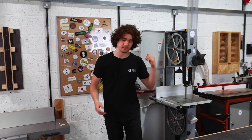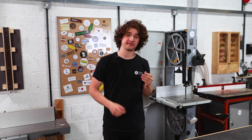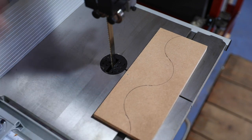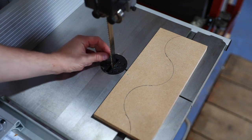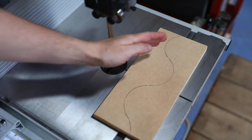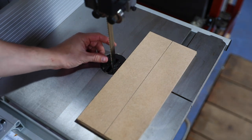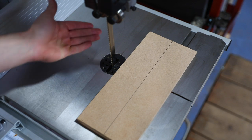The second specification is the width of the blade from front to back. This varies by machine — specifically the capacity of the thrust wheel at the back. This machine can take anything up to three quarters of an inch wide, which is around 19 millimetres, whereas smaller benchtop or hobby models usually only go up to a maximum of five eighths or even half an inch. If you're cutting intricate shapes like bowl blanks, you'll want a thin blade around a quarter of an inch to follow tight radii more easily. For straight cuts, max out your machine width.